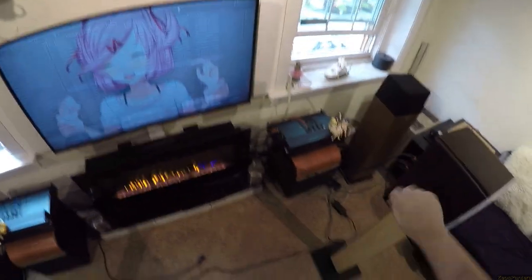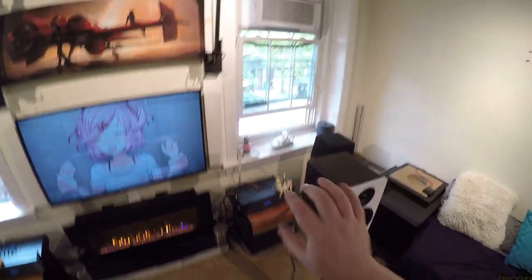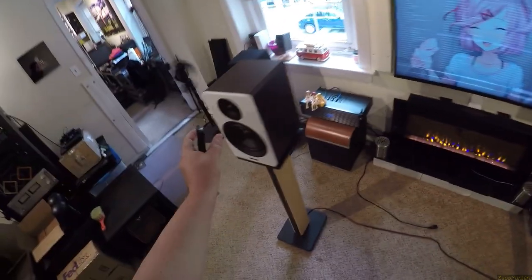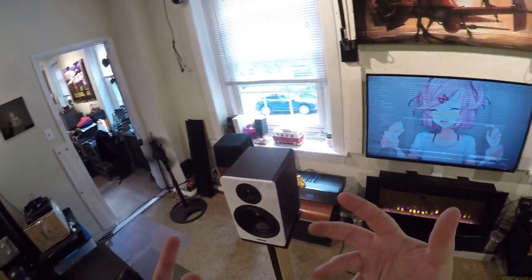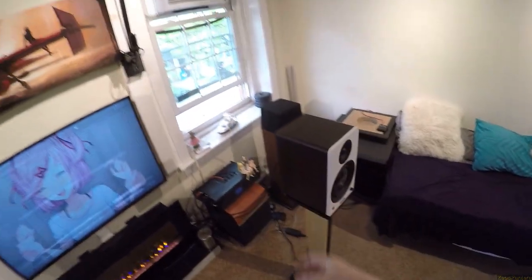Number one, if it was a proprietary 4-way screw-in connector like on the Rockvilles or on the Vanatoo or on the Swans, that means the amplifiers in the master speaker can individually tune the tweeters and the woofers without having to use a passive crossover like every other speaker uses. But since we're running just 2 conductors over here, that means there's a standard speaker crossover in here, which means there's just a stereo amplifier in here, not a 4-way amplifier.